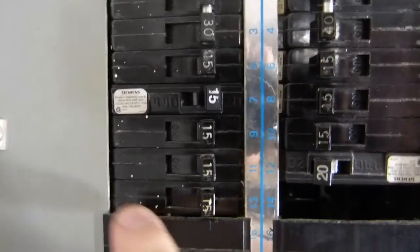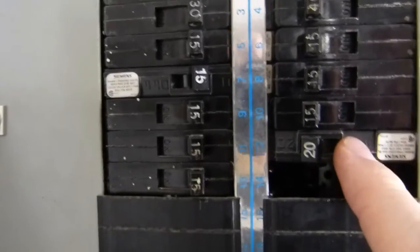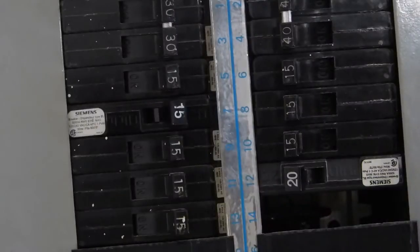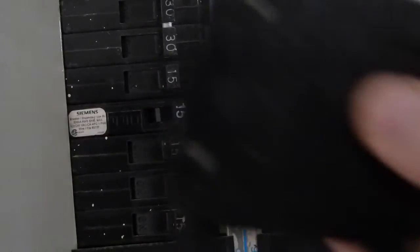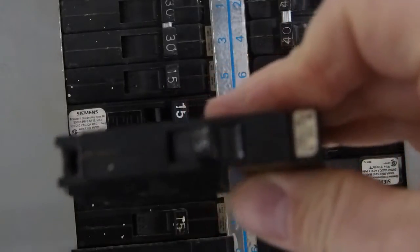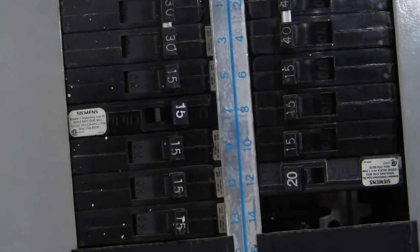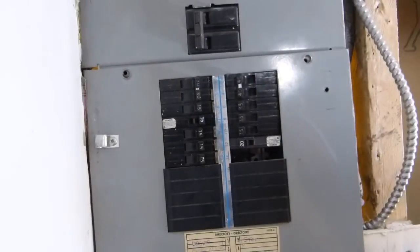Now, you can see two of them here are different — this one is different plastic, and this one is different plastic. Not only not 15 amps, but 20 amps. So the questions you should be asking are: what happened here, and why are those different? At this point you might hear an explanation — such as the breaker broke, and a 15-amp breaker was replaced by an identical single-phase 15-amp breaker, and that's just how the new ones look. That might very well be the case, but the only way to ascertain that is to have a look inside the wires yourself.